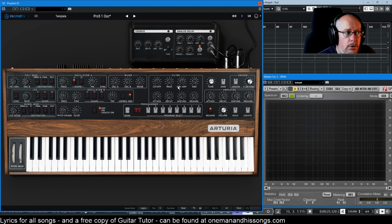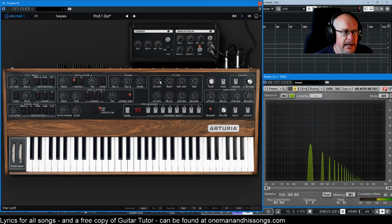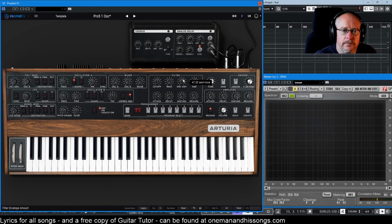We're not getting quite all of the way there as if we had no cutoff at all. That's really hammering the 20k. So it's not as if we can say we just add these two knobs together. It's not that simple. These are all logarithmic knobs operating over variable ranges. So be careful making any assumptions about what you can do with your conclusions. But we can say that the envelope amount incrementally increases the cutoff range during the attack phase.